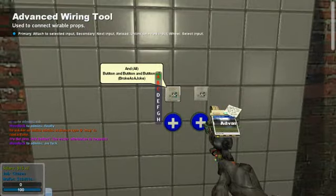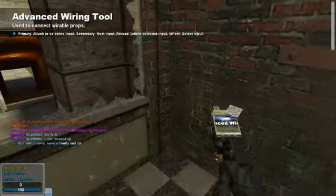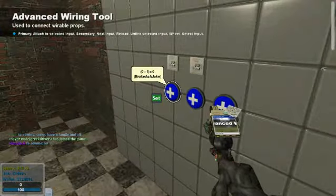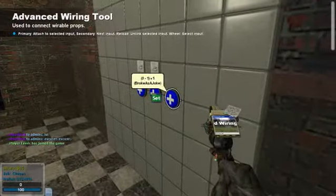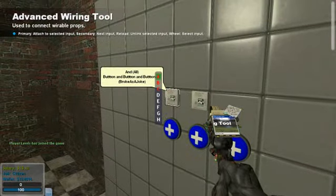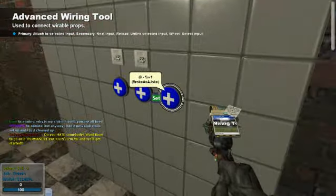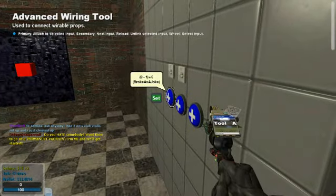So right now we have it hooked up to our AND gate. I want it to open if all 3 buttons are pushed. So basically, if me and my friend over here both have to push our buttons, and then somebody on the other side of the door has to push a button for some kind of super security, then all 3 buttons have to be pushed at the same time. You just would turn these buttons off toggle mode so that you'd have to hold it down. See, all 3 buttons are pushed. Someone lets go of their button, bam, it just closed. Green again. And then if you wanted to say, well, as long as one person is holding their button, then that's fine, it'll open. So that's any one of these buttons is pushed, the door's going to open. I can do this one, on and off, or this one, or this one.